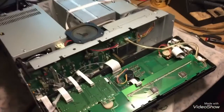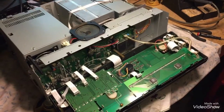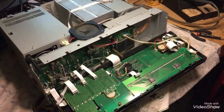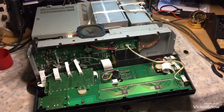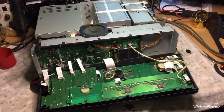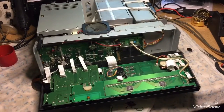We're also going to do some filter work to this radio by switching out the FL-80 and putting in the FL-70, and putting in the FL-223 and the FL-44A for broadcast quality audio, according to what we found online. So this is the beginning of our project — follow along. This is N2LEN out.